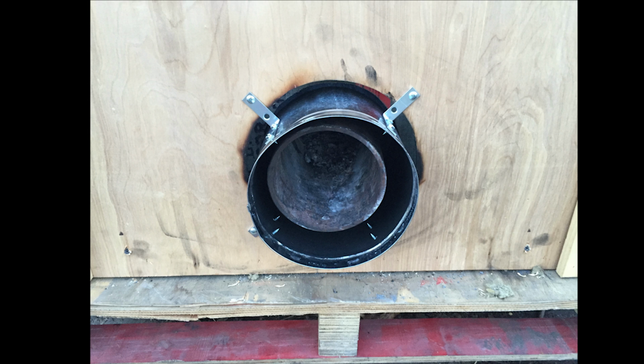One other design flaw was the rocket stove section was not making a complete seal against the 55-gallon drum, so there would always be some gas leakage, and that gas was leaking inside the wooden box, and we were worried that that was going to heat things up too much. So what we did was add a section of 8-inch chimney pipe that came through the outer section of the wooden box and fit up against the 55-gallon drum. Any gases that would leak from the 6-inch steel retort would be drawn out of the box and just escape into the air outside.